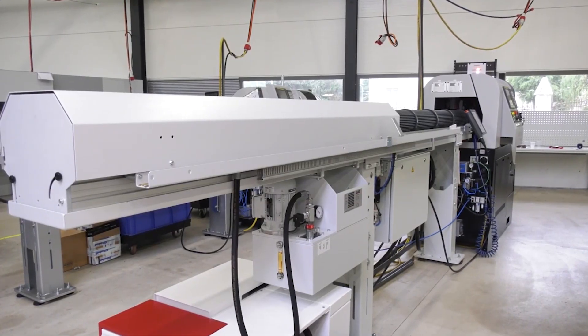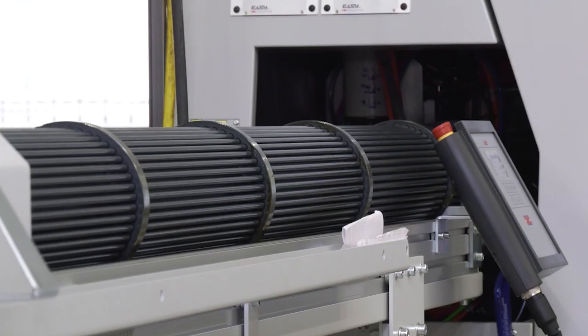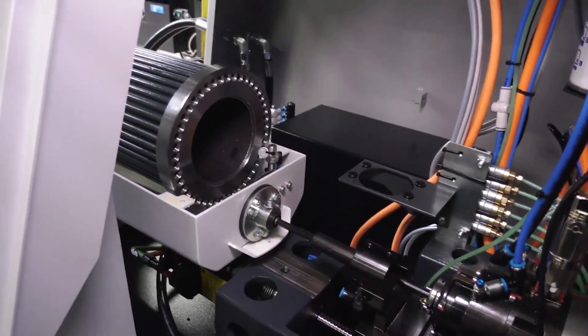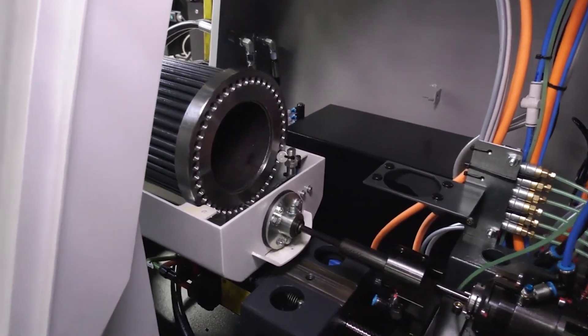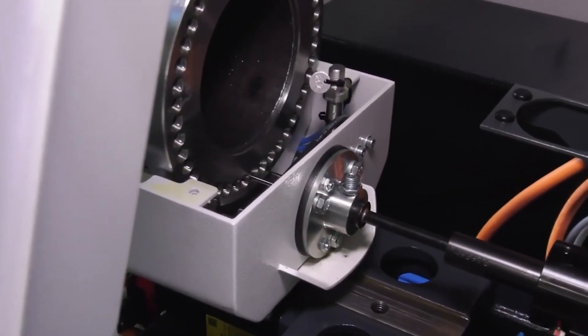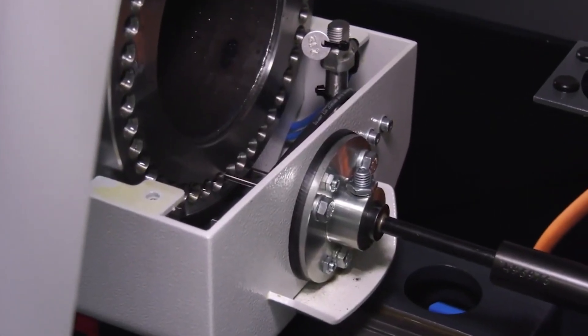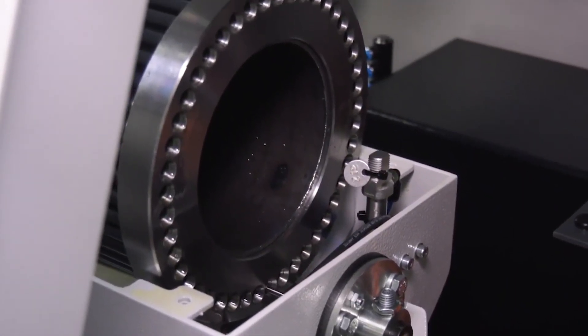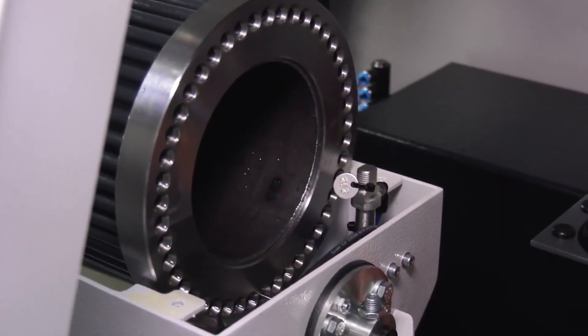It's a complete Tornos product — everything's kind of integrated, including the bar feeding solution, all as one unit. With the bar feeder, we have various options, from the Gatling gun type arrangement to a more conventional style bar feeder. What we're trying to do is incorporate those ancillary items within the footprint of the machine, so it makes a smaller, more compact installation rather than taking up a lot of floor space that is dead and not productive.